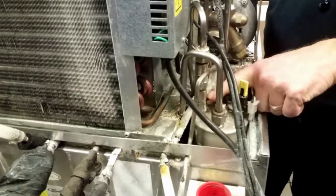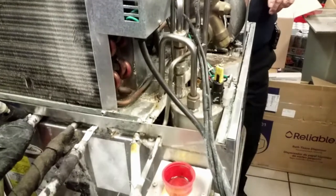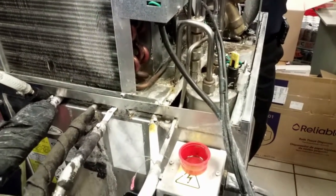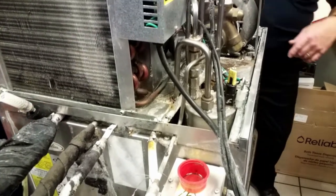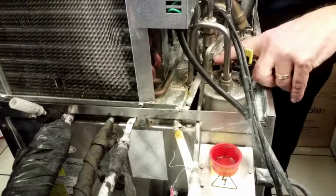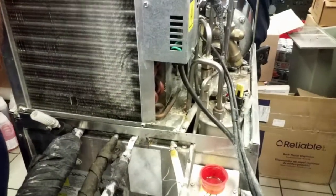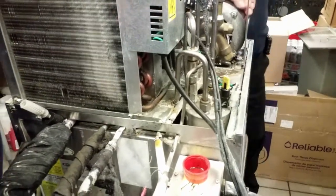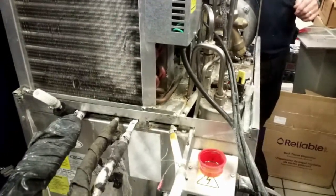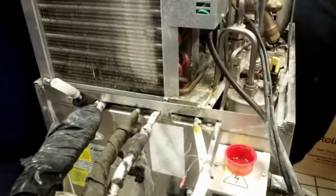The way to know when that double check valve has failed is you're going to get water out of the faucet that's carbonated. Or you're going to flush a toilet, and it's going to fizz, because that CO2 in that tank has made its way back through that check valve, back through the water line, into the system. I've seen coffee brewed with carbonated water. How are you possibly ever going to find that? It's one of those check valves.